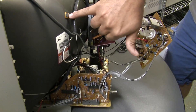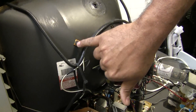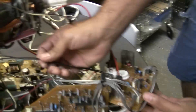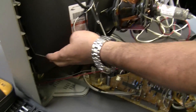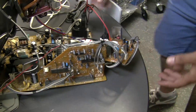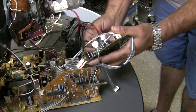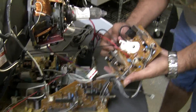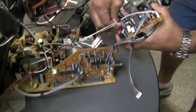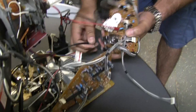Every time your TV turns on, that's why you hear that zoom sound — that's basically it degaussing the coil. As you can see, they did some convergence repairs right here — that's why you see a little magnet there. Convergence tape and convergence strips are hard to get because they don't really make them anymore — they're little tape metal things, just magnets and double-sided tape. This right here is your grounding strap. Every TV has a grounding strap, which is basically a piece of metal strapped to the four corners of the chassis. A lot of monitors are self-discharging when you turn them off, but I don't trust that — I always discharge it regardless. I've been zapped so many times working on open frame power supplies — it's not a good feeling.